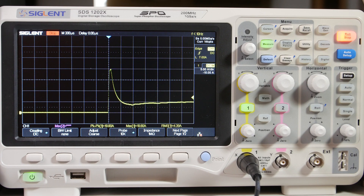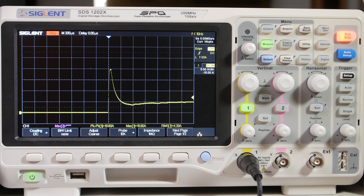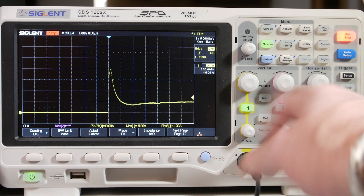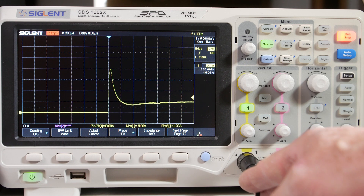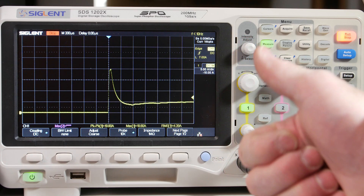There's the demonstration — I hope that helps show you how you can get around your instrumentation limitations. This meter is capable of 65 amps, but when I was doing inrush the other day, I could have split the wires to get the full peak current reading. But now that I've brought up the technique, I thought I should show it. Alright guys, if this was helpful, thumbs up please — thanks, see you next time.